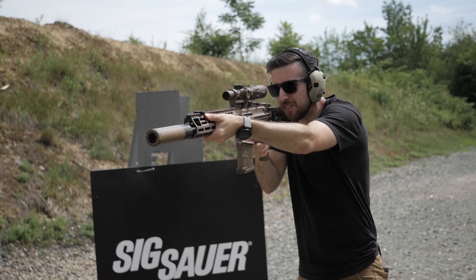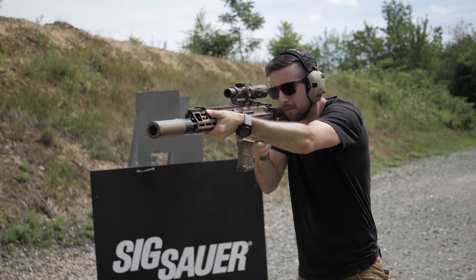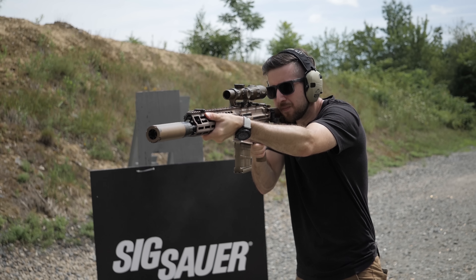We put a lot of emphasis on flash. Our end caps are designed to minimize flash as much as possible. The SLX and SLH lines both come in titanium and Inconel. Titanium has a history of sparking — there's a little more spark there and we're working on angles to minimize or completely eliminate it, though I don't want to get ahead of ourselves. The benefit for the end user: Inconel is heavier but handles higher pressure, higher volume, and more torturous firing — it's more durable than titanium.